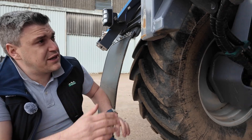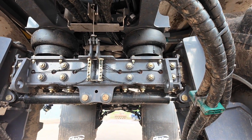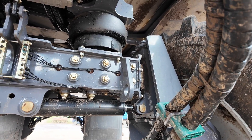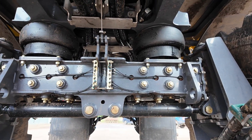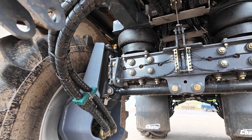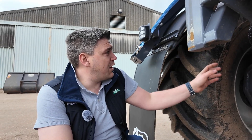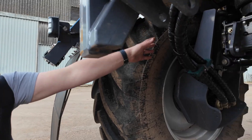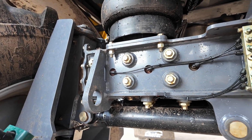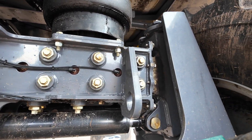This particular machine is fitted with our hydraulic adjustable track width. Standard Interceptors have adjustable track width, but that's done in 2-inch increments by removing bolts and pins. For contractors and customers wanting to vary the width throughout the season, we run the hydraulic adjustable track width — that's why it's got some extra grease lines. Each ram gives feedback to tell us exactly where it is and that it's got to the right point. Even going to sliding axles, the kingpin post on our steering system is made of billet steel — that whole T-shaped chunk is billet steel, not box section fabricated, so as strong as possible.